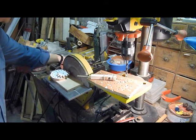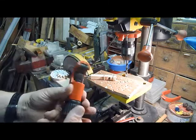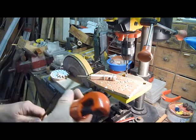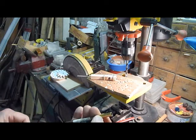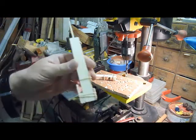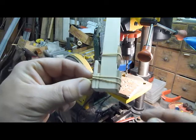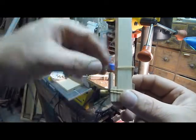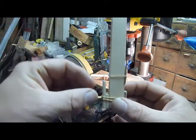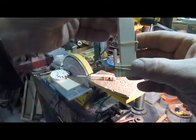The last operation will involve taking a pipe cutter — a good quality pipe cutter — for neat cuts, and cutting small lengths. For the smaller pipes I'm using about 22mm lengths, cutting small lengths of pipe to insert in the back hole. So the pipe will clip onto its board and the hosing from the tracker bar will plug in on the back here, and that little pipe is just pushed in here flush with the back plate.